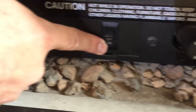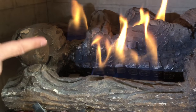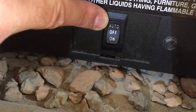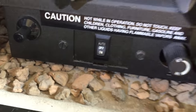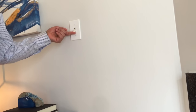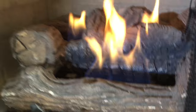Now because we turned this switch to on, the fireplace comes on automatically and stays on. But we want the flexibility to be able to flip it on and off without coming down here and getting ourselves on our knees. So we're going to flip this switch from on to auto. When it's in auto, the actual fireplace should be off until we flip the switch over here on the light switch. Now we can control the fireplace from the light switch, which is a lot cleaner and easier. Flip this on, on comes the fireplace; flip this off, and the flames go away.